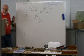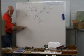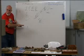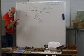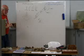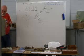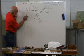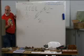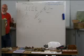You do that on a polished steel block we call a jeweller's steady, and because the steel is polished and hard, the mishap, the mis-engraved line, is then pushed forward and literally erased. And all you have to do then is get a little bit of emery and touch it up, and you might need to go over that line again to re-engrave it, because where you had that little mishap, you might lose that little area of the line. So you might just have to re-engrave through there to bring it back. But it's as simple as that.